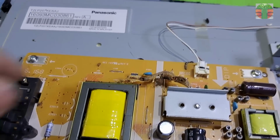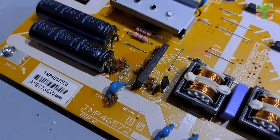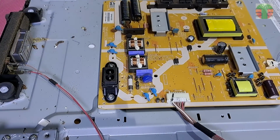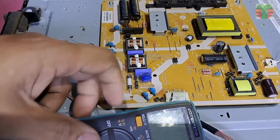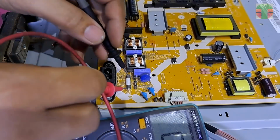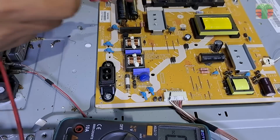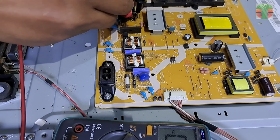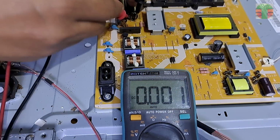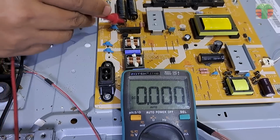A mummified house lizard shows in the main power supply and a group of dead ants stack on the terminals of the main capacitor, and also on the rectifier diode. The fuse is not busted. And the capacitors are not charged or have no voltage stack on them. It may be because they are damaged now caused by the corrosion.